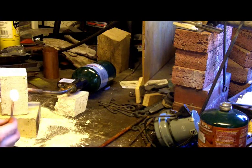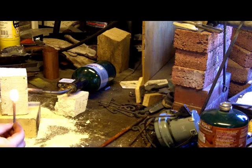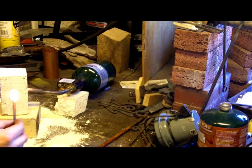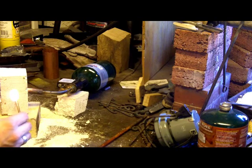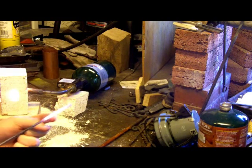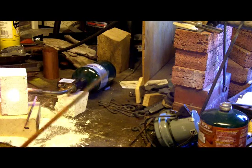One thing that is nice about having a small forge like this, in addition to its portability, is that it will only heat probably an inch or an inch and a half at a time. So if you decide this is something you want to use for knife making, you'll only be heating a small section of the blade, which is about as much as you can work in a given heat anyway. You see videos mostly in the movies of blacksmiths taking swords out of the forge that are red down their entire length — it's not really realistic because they're only going to be able to work two or three inches of that sword in that heat. Hopefully the camera's picking this up — we have bright orange in here, duller on the ends. So we're going to put this off to the side and see how it does on something a little larger, like 5/16ths.